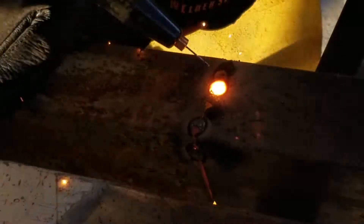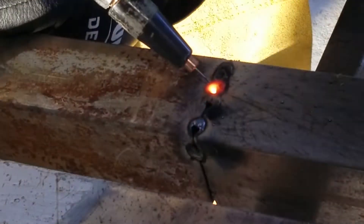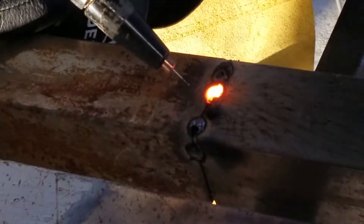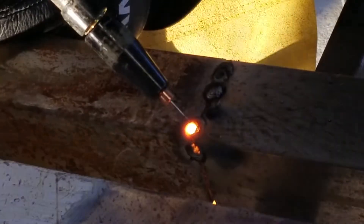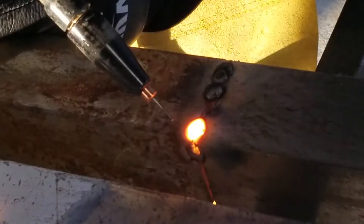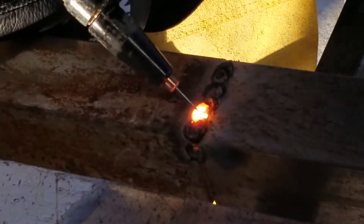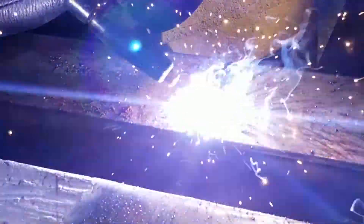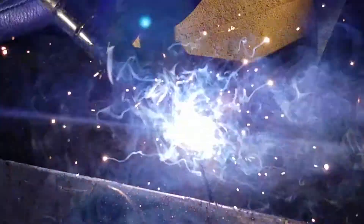The reason is that when you're welding, you're not only melting the material together, you're also making it harder. You're creating a hard point in your steel that will allow the metal to react differently versus running on two pieces of virgin metal that haven't been welded on. Aside from hardening the metal around your weld, you're also warping it. As you're welding, you'll either bow up or it'll dip down. After you run through a bead you're going to have either a dip or a bump, and not all of that is due to extra filler material — a lot has to do with how the metal warps as you're heating it. Because of that warpage, it also tends to cause holes, since the metal is moving around as you're liquefying it. If it gets too hot, it tends to drip.